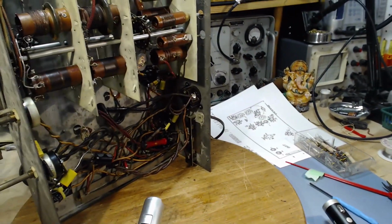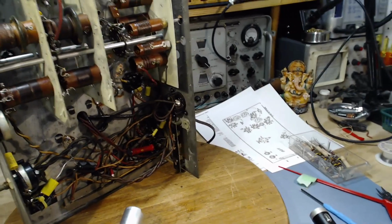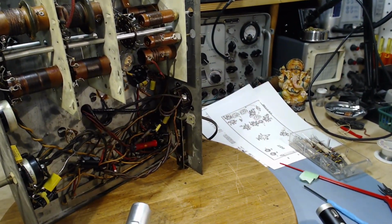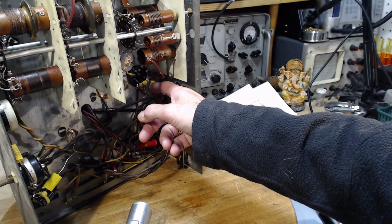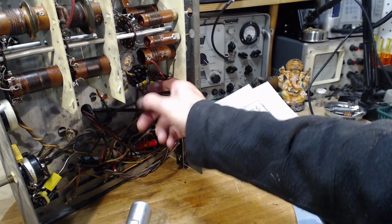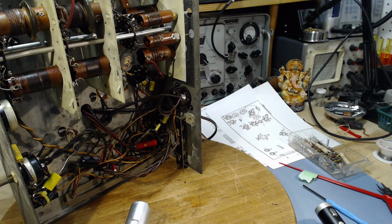Came in this morning thinking, well, I really should fix up that capacitor soldering. I mean, it's right on the tube that I'm having trouble with, the circuit I'm having trouble with. Goodness knows if it was really on there, so I decided to check it again. I just reached in and went like this, and I went pop, and came right off. So it's off. Maybe this is the problem. So the bad news is really the good news, that could be the problem.